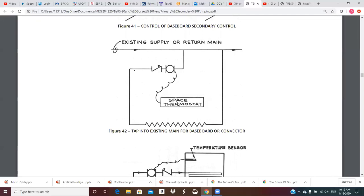This could be 140, 150, or 130 degree water — enough, if you size the coil correctly, to condition a small space. Or it could be a supply. You simply tap in, pull out of that line, pump it through a coil, and put it right back in the same line, cooling it down maybe 10, 15, or 20 degrees. If this is a significant flow in the main, pulling a small amount out and cooling it down a little before putting it back probably isn't going to cause a big problem. This pump just starts and stops — when it's off there's no driving force to move water through the secondary circuit, since these connections are close together with little pressure drop across them.